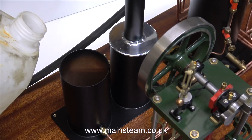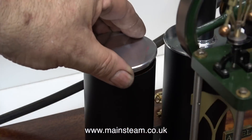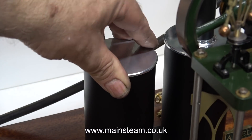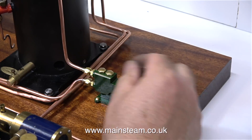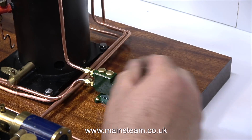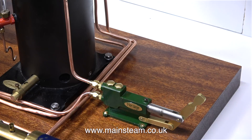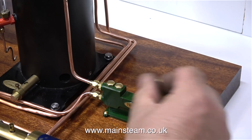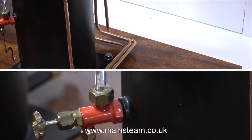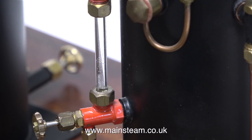It's time now to test the water piping. I'm putting some water into my water tank, replacing the aluminium cap, and then it's over to the hand pump. By vigorously pumping the handle on the hand pump, the water is slowly pumped out of the water tank and into the boiler. There's a nice lubrication point on the top of the hand pump, so I applied some oil and then it was back to the pumping. I ended up using about a tank and a half of water to get the water to the level you're about to see in the water gauge.